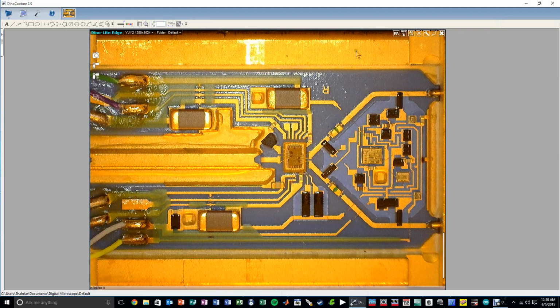They're just biasing, and you can see the chassis is of course a nice, big ground, everything is shielded. This is not hermetically sealed, and I don't believe the chips are covered with anything. So pretty cool to see. And I'm not sure what technology this is made in. By the look of it, I would say either an old SiGe or a CMOS process. There's a couple of other little ASICs there, but nothing major. But clearly all the magic is in this indium phosphide chip in the front here.